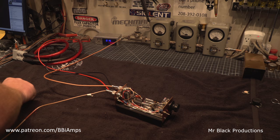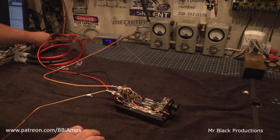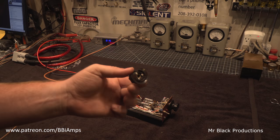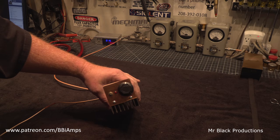I got this thing running — we put 454s in it. It's really, really spectrally clean. I could get it to do a little bit more peak power, but with this size transformer, that extra peak power on the watt meter was turning into garbage. The knob that was broken — I was able to find one exactly the same style, but not numbered, so we're going to put labels on it.